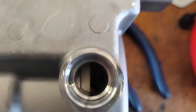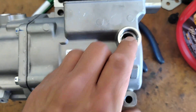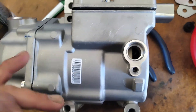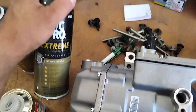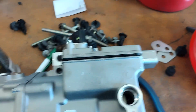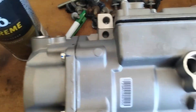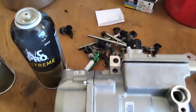It did have oil in it, and I'm glad I checked because nowhere on this compressor does it indicate that it had oil. If I had just followed the books and added four ounces of oil, it would have had too much oil in it, and when I engaged it it probably would have blown and caused damage. I went ahead and drained as much oil as I could out of it — I think that's only about two ounces, so it likely had oil just for manufacturing and shipping purposes. Now that I've got most of the oil drained out, I can add my own oil, knowing exactly how much is in there.